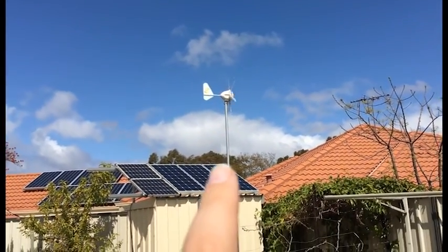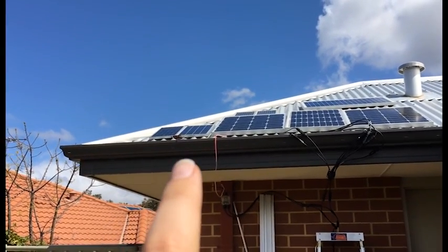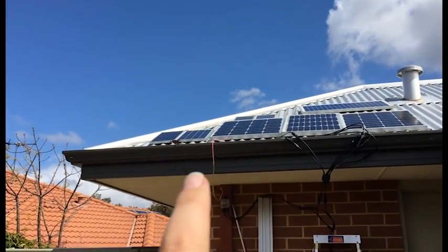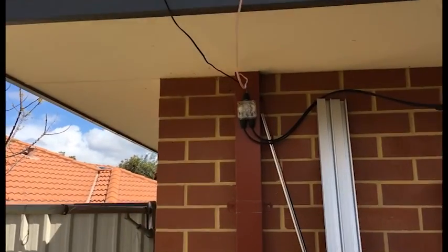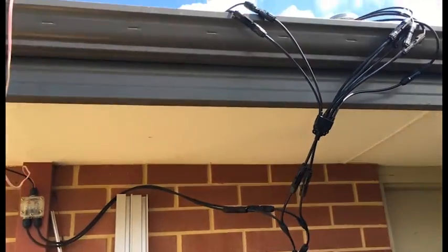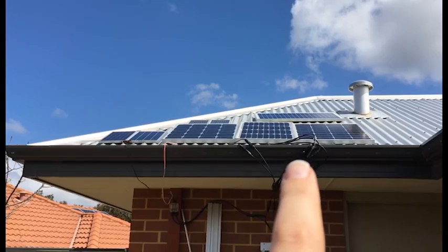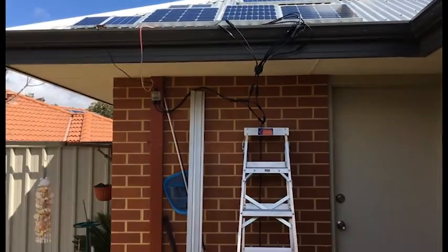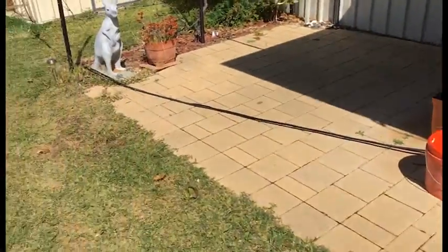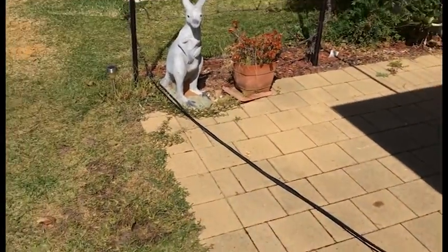The wind turbine is not connected to any of the panels. And the ones over here — there are two joined together. They're two 10s and two 5s. They're polys. And they go into this junction box here and then from there they join up with the others. Right up the top we've got a 40W poly and the three down below they are 40s but they're monos, and they join together through this connection. They're all quick connects and all solar cable.